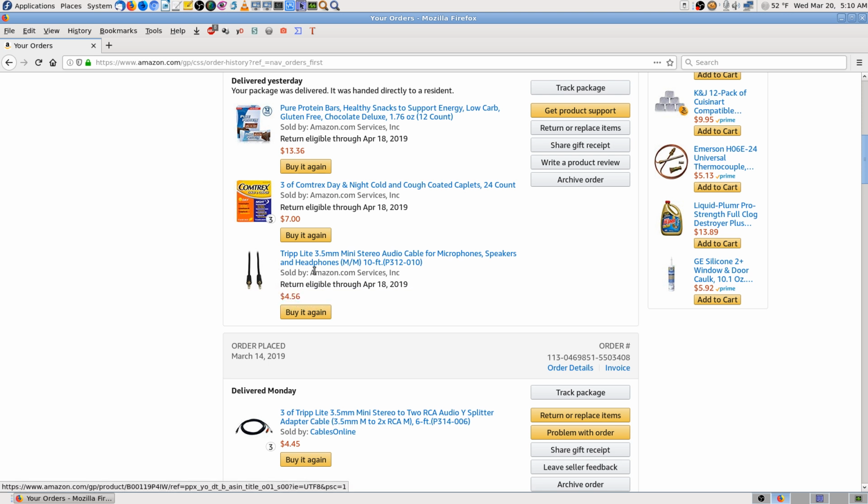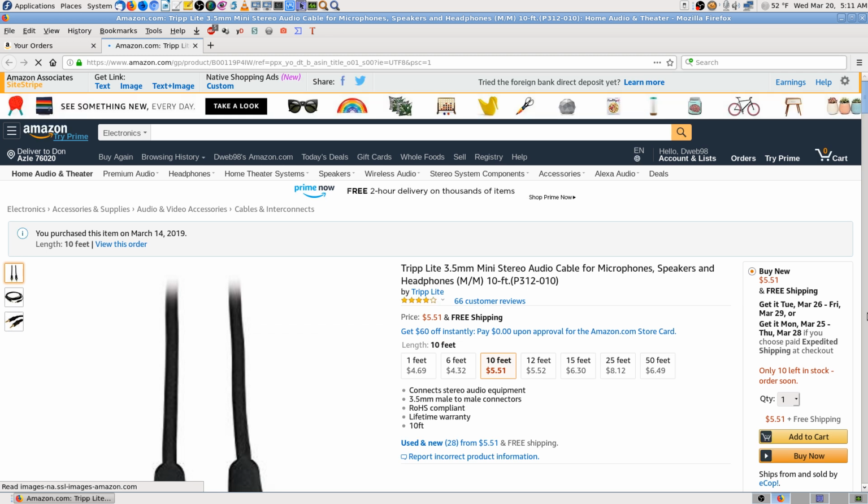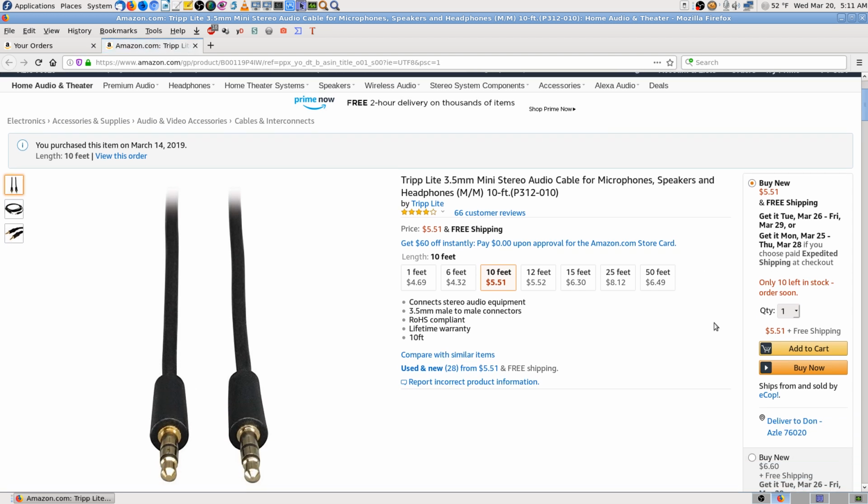And so here's the cable I got. And hopefully everything's fine with it. I think it is. It had a good signal. I think the reason nothing was on the left is because this board's not designed that way. It works just fine. I have it plugged into a stereo output, and that's sending the stereo signal down the cable. But where I plugged it in was really looking for TRS or a balanced signal. It wasn't looking for a stereo signal like I thought. So that's why when I panned to the left, I got nothing.